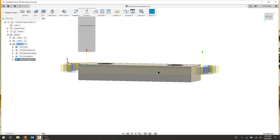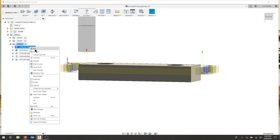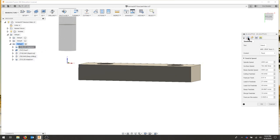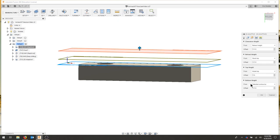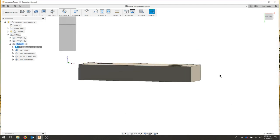That should complete the top side of my jaw. If you'd rather do your contour or adaptive clearing first, you're welcome to do so and then face off the top of the material and drill your holes. You can always drag your adaptive above the face and then edit your path — just make sure when you go to your heights tab that the top height becomes the stock top because you haven't faced that yet. Now we've done the outside of the part, then we can face it off.